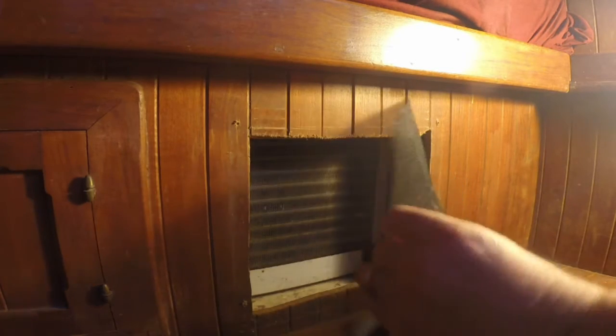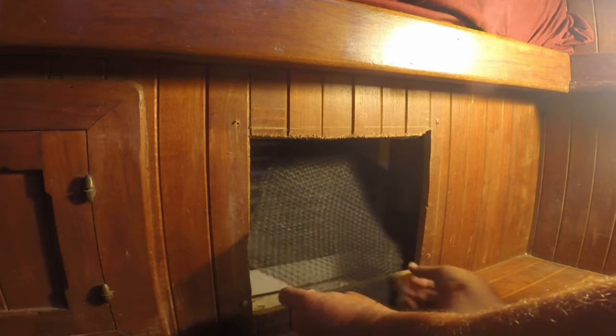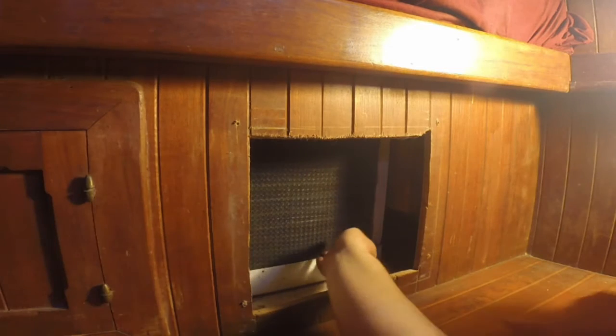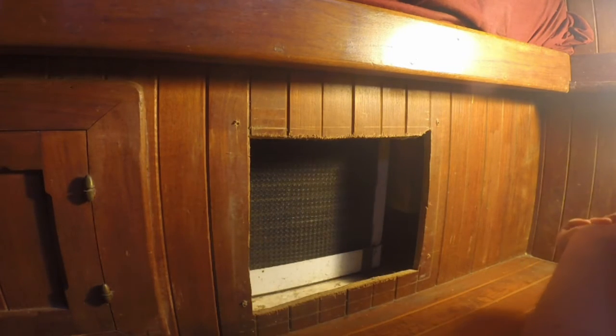The next step is really to just put this filter back in. I like to put these in the same way they came out. If it gets a little bit crusty or gunky down on the bottom where it goes into the drip pan, I tend to keep that on the bottom side. This unit, instead of sliding from the top, it's a little easier to slide it in one side. You want to be really careful not to bend those fins. Then we're going to do the same over here on this side, and once we have it behind there, we'll just slide it right down into place — all the way down to the drip pan. And we're nice and clean.